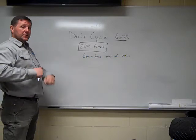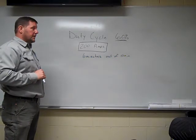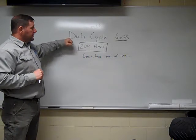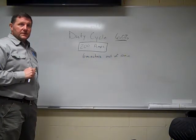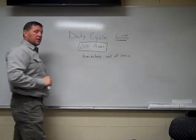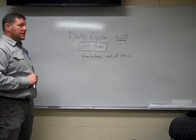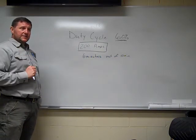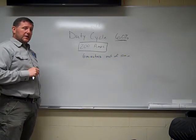If you want to purchase a welder for your garage, or you're doing some odds and ends out in your garage, look at the duty cycle and understand what it can do. Remember, it's the percentage of the time it can handle at max amperage. So that's basically it for chapter 3. It's more of an introductory chapter.